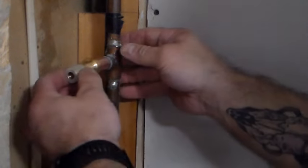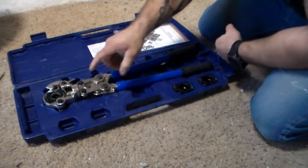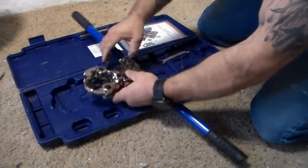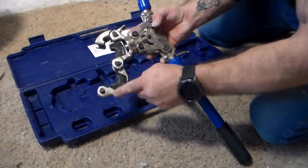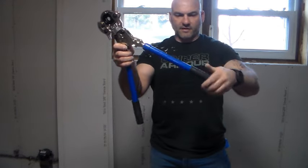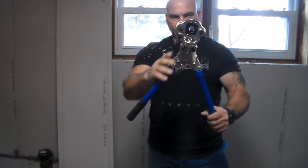We've cleaned up the inside and outside of our copper, so I'm going to slip the ProPress fitting on there. You'll feel it bottom out so you'll know it's on all the way. Now I already have my half inch pieces in here, but if I needed to change them out, all you do is open up the arms, press this button — that opens up the head — and there are two screws that hold the pieces in. Just switch them out with the other sizes and close it back up. I could also extend these arms down by giving them a twist for more leverage, but in the tight area we're working and only being half inch, I'm going to keep them fully in.